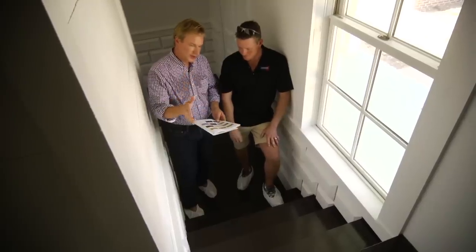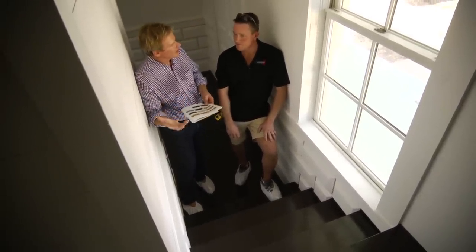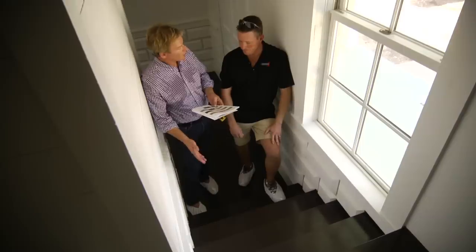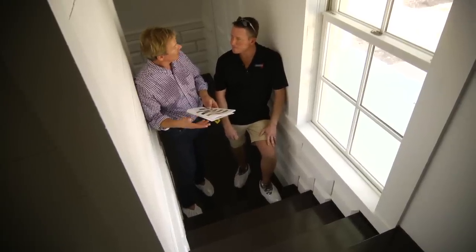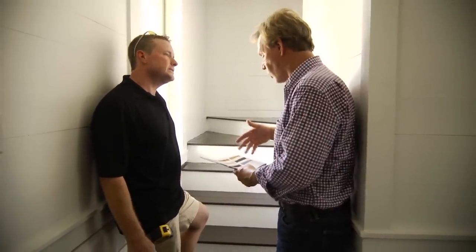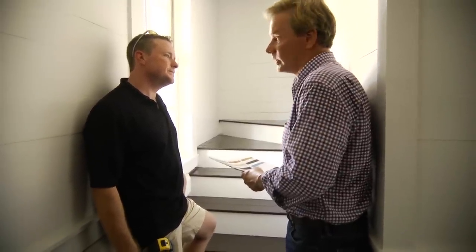If you're doing a stairwell like this, are they typically a custom order and you have to give plenty of time? It's not something you're just going to pull off the shelf. On these orders they take a week to ten days to get in, and we schedule from there. We just order the width that we need unless we order it from them bound. So you measure it out, get the amount you need, and then you do the binding in-store. These natural fibers like sisal and coir are really no more difficult to put in as a stair runner than conventional carpets — not at all, other than the binding.